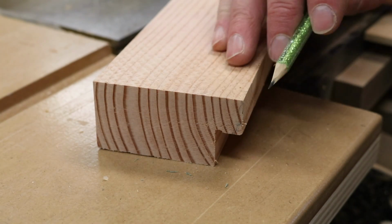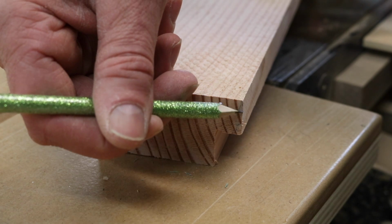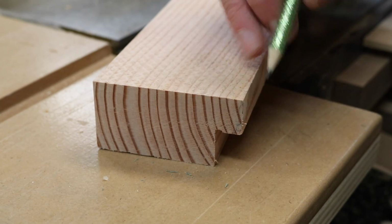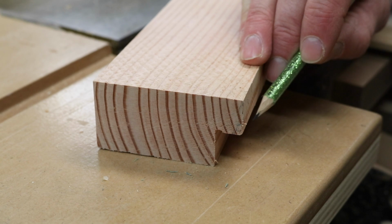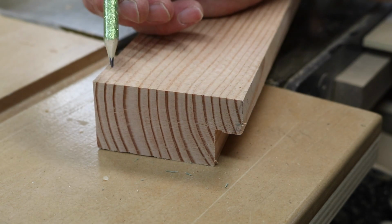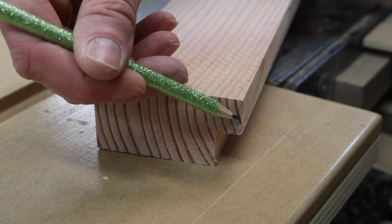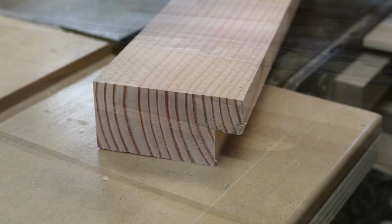The next step is to make a place for the chalk to rest. So I'm going to cut a 3-degree angle on the inside of the frame, and that way the chalk will roll into the chalkboard as opposed to falling off the frame. And to do that, I'll set the fence at 2 15/16, raise the blade, and set the angle of the blade at 3 degrees.